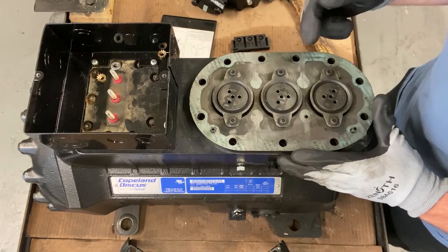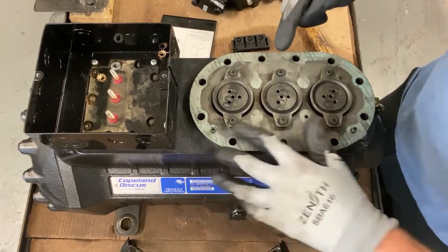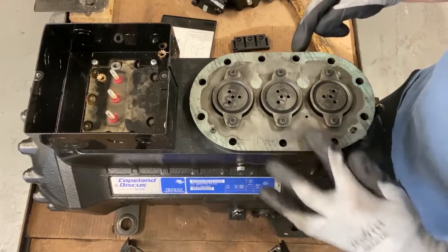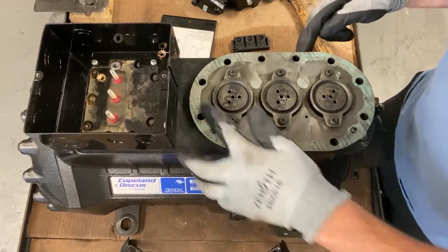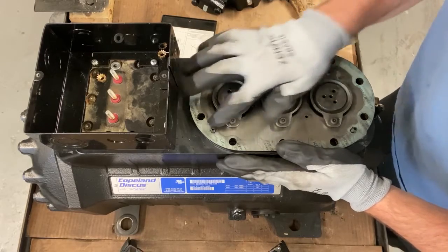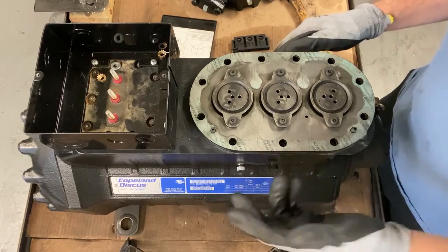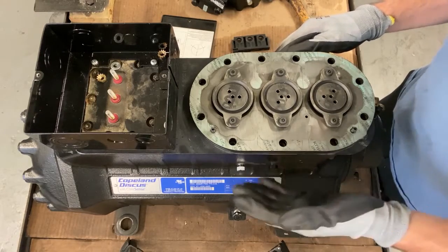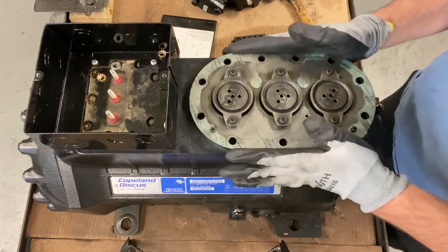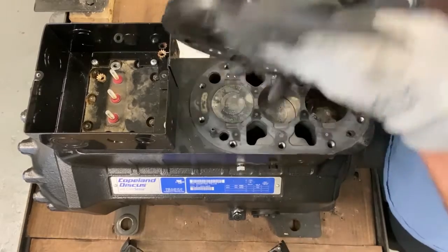Like I said in the presentation, if you can clean this off, and see how I'm cleaning this all off, and it's back to its regular color, that's mechanical wear. What causes that? Mechanical wear. So it could be rings, it could be pistons, whatever it is, where that made it up through here. So next step is taking this off and checking this side.